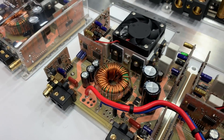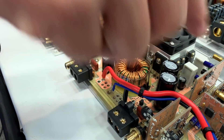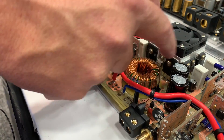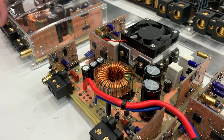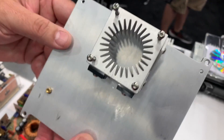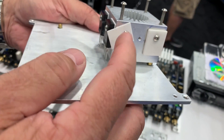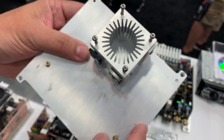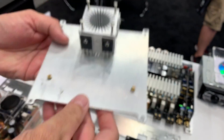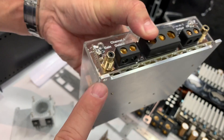There's a cooling system going on here. After the signal leaves the Class A amplifiers, it goes to the Class AB current stage, and that's where it does the heavy lifting. All these devices do the heavy lifting and they get hot. So in order to deal with the heat, we came up with a solution like this: a heatsink with a whole bunch of fins, a lot of surface area, and these awesome ceramic isolators. A fan bolts directly there. Cool air comes in, gets all the heat, and then shoves it out underneath the circuit board and eventually out of the amplifier. Beautiful thing.